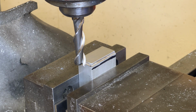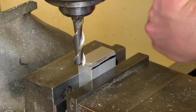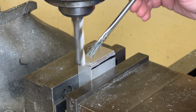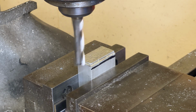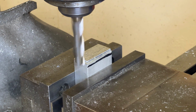Okay, so I'm going to continue with conventional cutting, which means I need to be traveling around the part in a counterclockwise direction. That way I'm scooping as I'm traveling. Let me go ahead and turn on the machine. Put a little bit of oil on. And now I'm going to set the depth to 50 thousandths. So I've moved the table up 50 thousandths using the setting there.